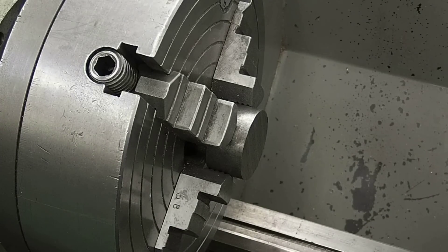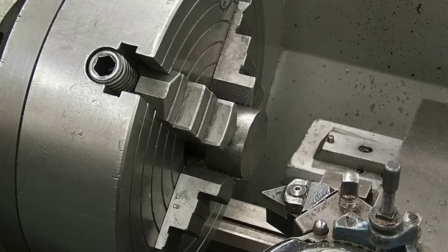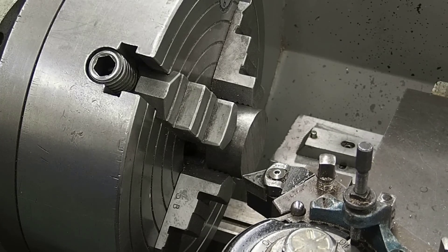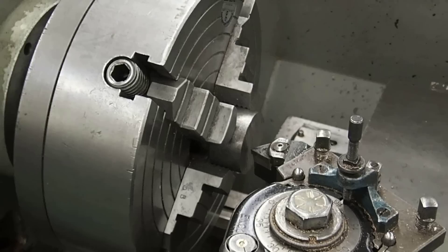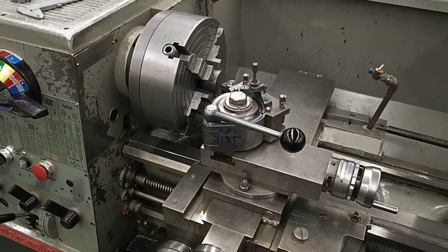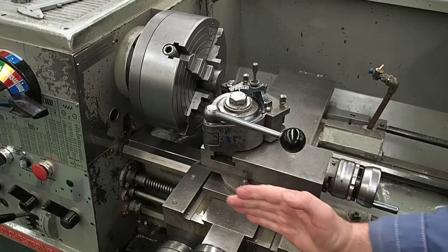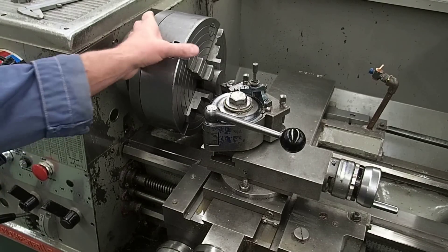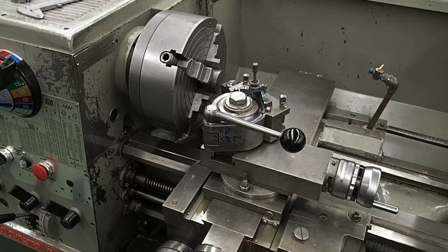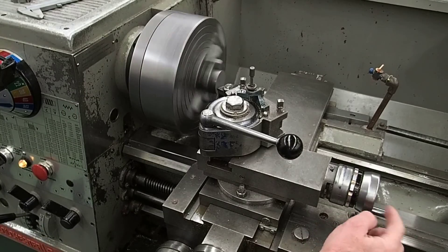I have a carbide cutting tool set up - a right-handed turning tool set off on an angle because we're going to use it like a facing tool. I'm going to run it up close to the part and zoom out. I'll tighten the carriage lock to keep the carriage from moving back and forth and keep the cutting tool in contact with the workpiece. I've already set up the RPM, the feed, and checked the direction of the feed, so I know the tool is going to feed in this direction.